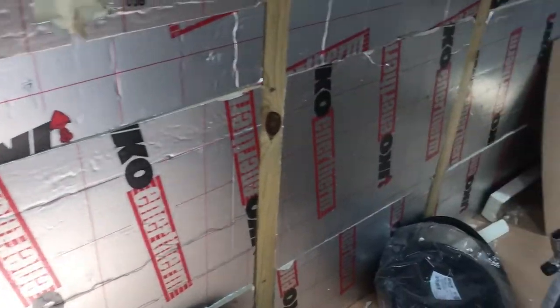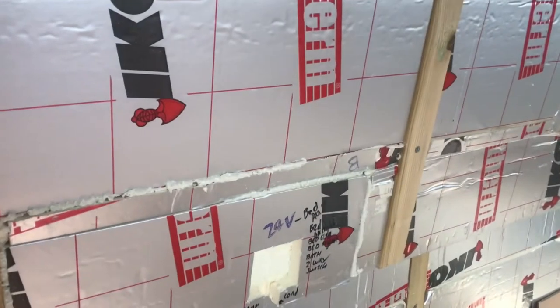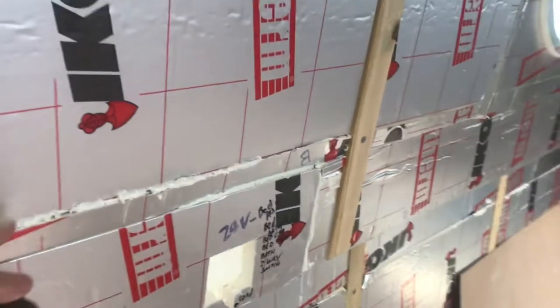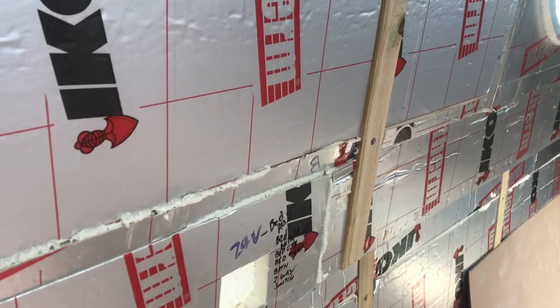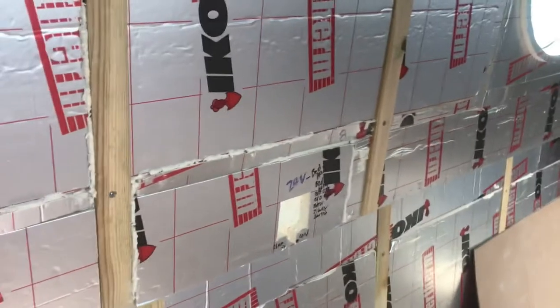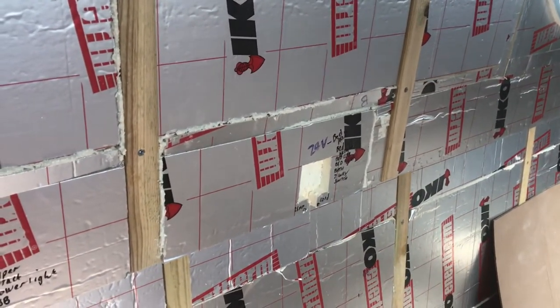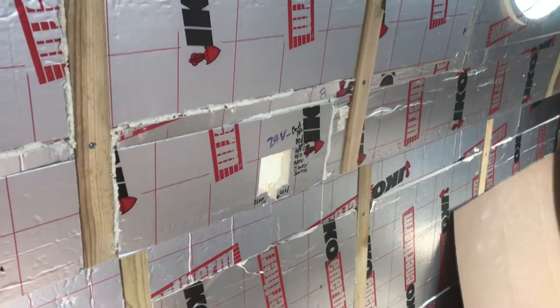Basically, when I started doing this, I started at the very end putting quite lots of foam in, but then I realised I was just overdoing it, because I'm basically going to now go through it and seal, as I've done here, any sort of big gaps in this. And then once that's done, I'm going over with aluminium tape to really seal everything off. So it was over-egging, or over-foaming.